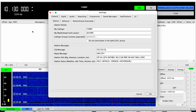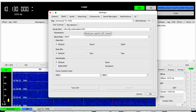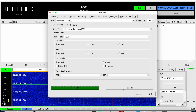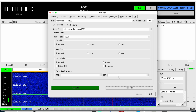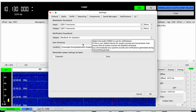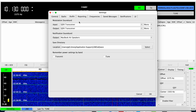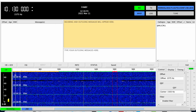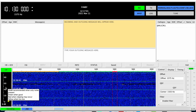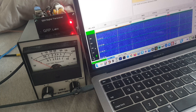I have all the right preferences. Radio TS440S. I have the correct serial port here that's working. I can test CAT control. PTT works fine. So everything is working. The audio QDX transceiver — the great thing about the Mac is that you can send the notification sounds to another output, the speakers. But everything is seemingly working, except I get a very low reception level here. This should be around 50, but it's suddenly about 10, and I'm a little worried about that. Let's tune and see what happens.